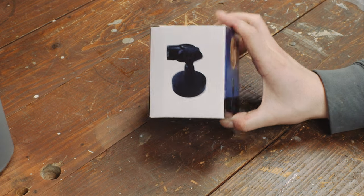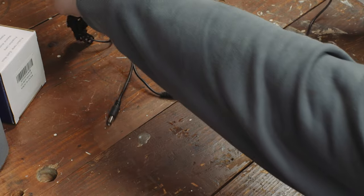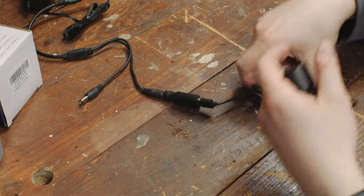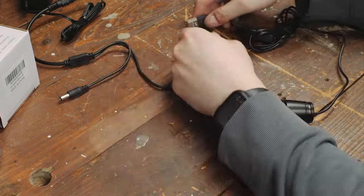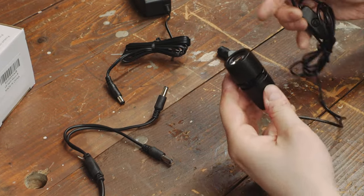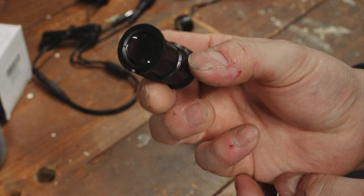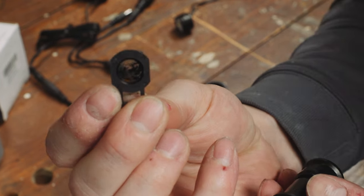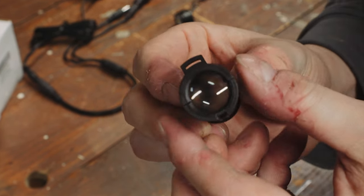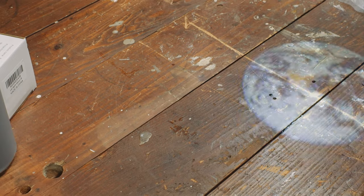To start off, this projection lens is sort of the centerpiece of the build. I spent quite a bit of time online trying to find one with the right dimensions, and this one ended up working out perfectly. Links for everything I used in this project will be in the description. I purchased a few other power cables and adapters online — it's a 12 volt DC to a splitter with one end going to the projection lens and the other going to the LEDs and sound. This lens was almost made for this project since it's got a removable planet projection slide and actually came with quite a few slides with various images. Here you can see the image I ended up going with, which is just a picture of Earth.